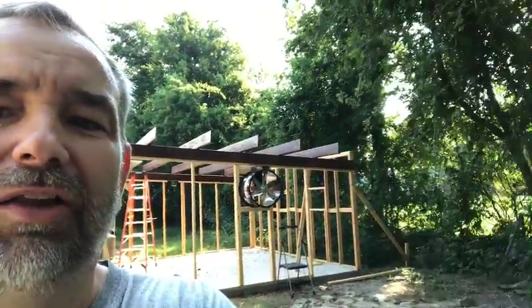I'll have the outside of it done, the roof on it, the wiring done, lighting in it, and white plastic sheeting on the inside. And then I can just put insulation behind the white plastic sheeting, and then I can put either OSB or half inch plywood, so I can get smooth walls, so they're easier to clean and they collect less overspray. And I can use a gloss type finish on the walls to let things not collect in there as much.